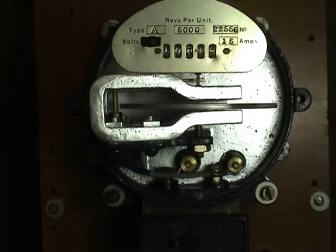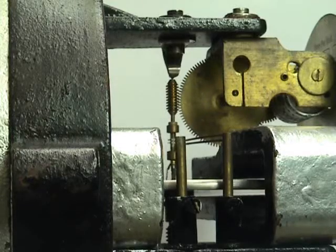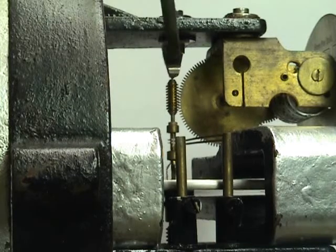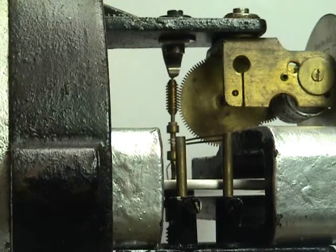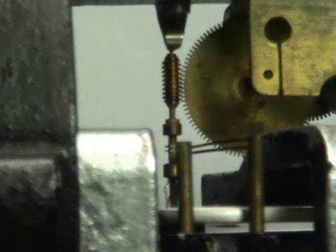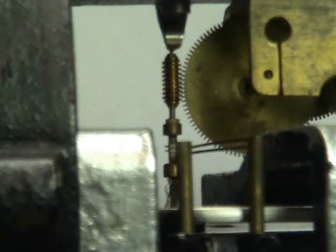The meter uses an aluminium disc. In the disc there are three coils which are being fed through a couple of beryllium springs in a commutator. The commutator can be seen here, along with the lead-in and lead-out terminals. It's actually amazingly made, considering this is from the turn of the last century.